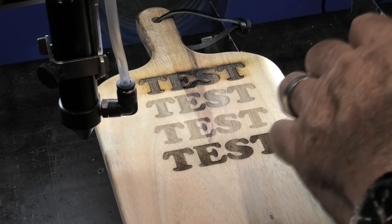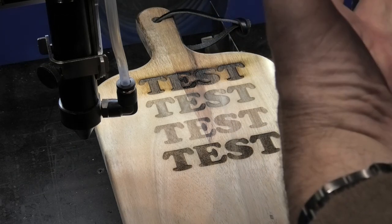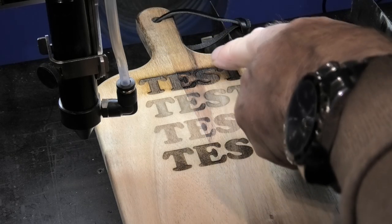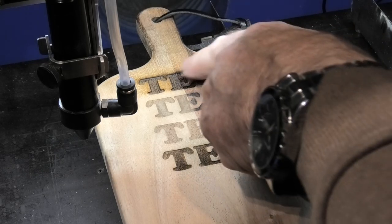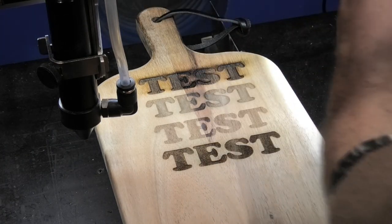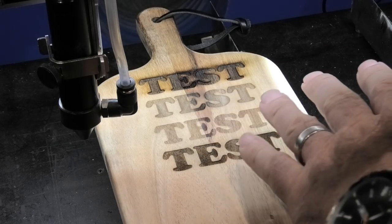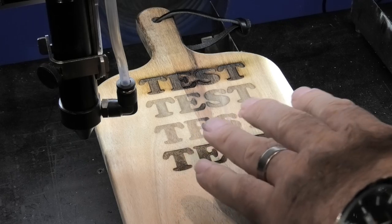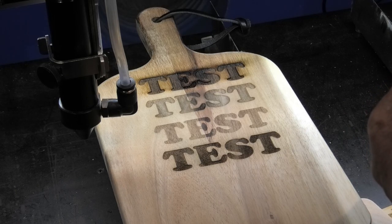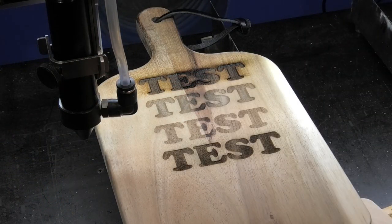And when the jelly shakes a lot, the molecular structure starts to break down. Some of the atoms in that molecular structure fly off, and they become something else. Fumes, all this crud around the outside here. If you look here, you'll see that the crud around this dark area is much greater than the crud around the lighter area, because there's a different chemical reaction taking place when we vibrate these molecules. The faster we vibrate them, the hotter they get. But it's not heat that's causing the molecules to break down. It's the physical, mechanical, kinetic energy in the vibration which causes the bonding between the molecules to break down. So it's an interesting physics phenomenon that we look as though we're burning this material, but we're not. We're shaking it to death.